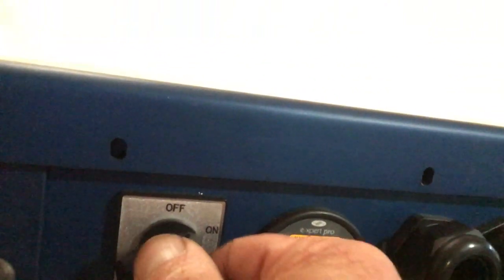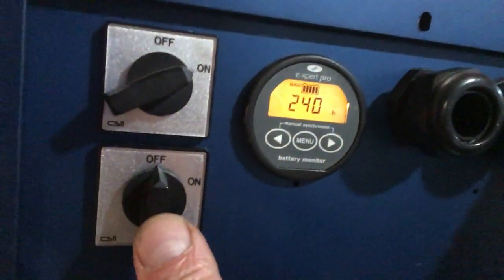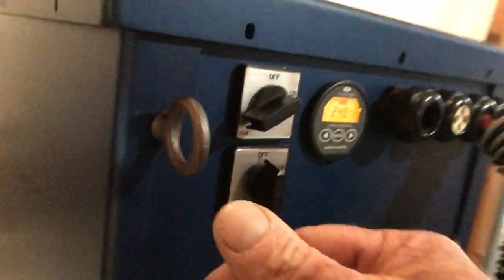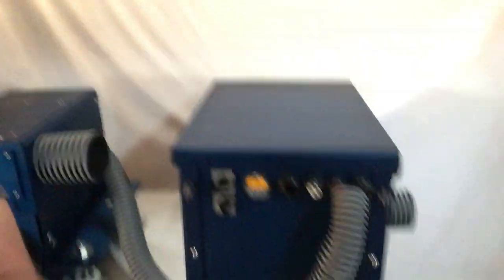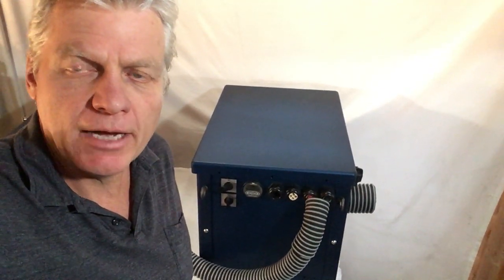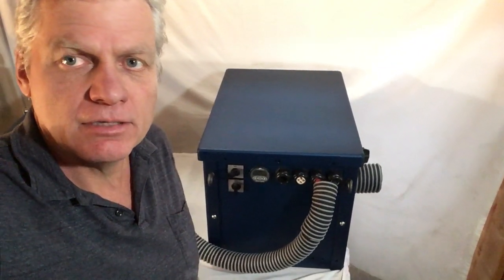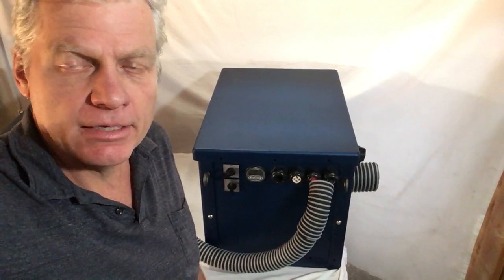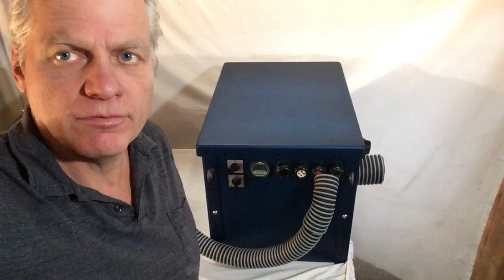Here you'll see our switches. This switch turns the balancer on at the same time as the charger. This turns on the inverter. You'll notice we have provided lifting hooks, which can be removed once the battery is installed. We use Northstar pure lead carbon batteries — very efficient batteries. They charge rapidly, they last a long time. We're getting 10 to 15 years out of our battery packs and they stay in balance a long time as well.